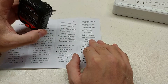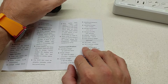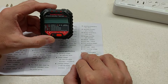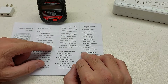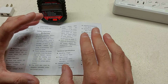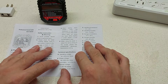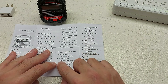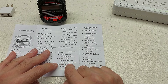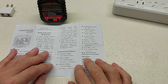I'm starting to get the inkling that this device is the same circuit board inside, just with different connections depending on where in the world it's being sold. Phase voltage — we are only going to be measuring one phase with this, since we're just plugging it into a normal receptacle, not a dryer or oven range. The phase voltage works 90 to 250 volts and 45 to 65 Hz, accuracy plus or minus 2%. That's not bad, and this still covers the North American range — we fall inside there.